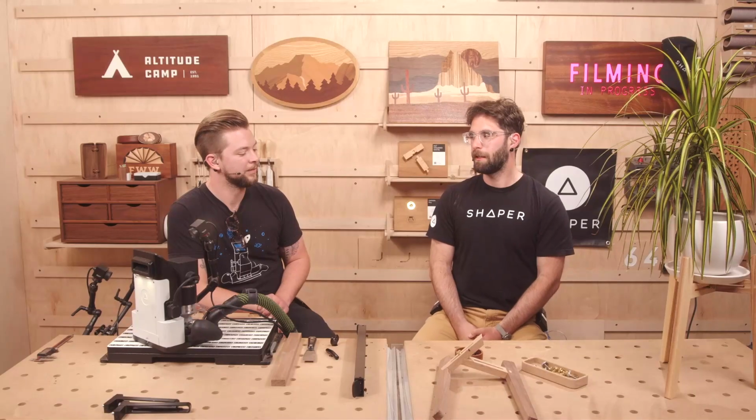One thing that we did here for the first time for Jake's chair that he made last month was model making or prototyping, both on a smaller scale and on a full scale. Like we made, I think, a small mock-up of the chair to make sure that the proportions were right, and then a full-size MDF chair, just slapped together, dimensionally accurate but not aesthetically accurate at all, to make sure that it fit the body of the person who is going to be sitting in it.